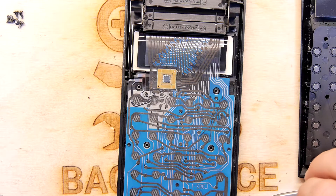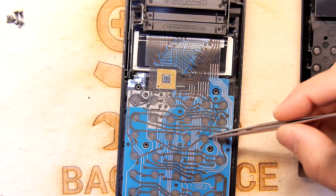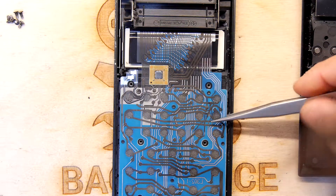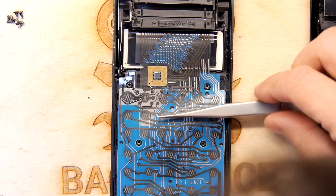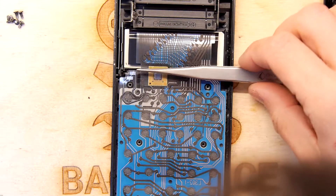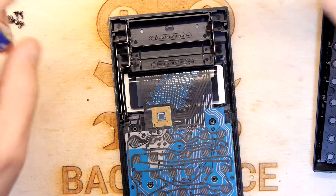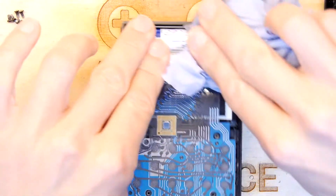I'm going to look at other calculators now to see if they've done the same thing, because it's really quite amazing. You can see some corrosion on the layers. The tracks are generally silver, but here some are black, because something's got in between these two layers — leaky battery. I'm just pushing my tweezers between the layers. That does not look too good. The reason is you can't solder to repair these things, so that's going to be a bit of a pain. Maybe if we're lucky, the corrosion isn't terminal.